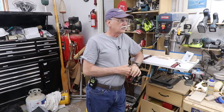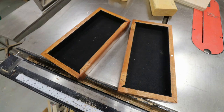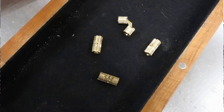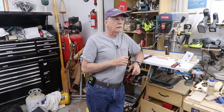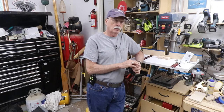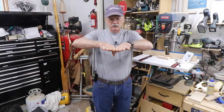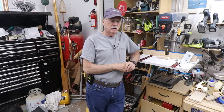Do we really need an excuse to upgrade our tools? Not really — I kind of made an excuse. A friend of mine has this game box that someone had modified earlier with some butt hinges that never really worked right, and when you open the box up to play it, it wouldn't lay flat. So what I'm using are these barrel hinges — they're like Soss barrel hinges but not Soss. These are 8 millimeter, but the depth for these has to be fairly precise. They don't have the expansion barrel like the bigger ones do; you have to put two screws into it, or epoxy them. This way it closes the box up nicely, and when you open it up not only will it lay flat, but there'll be almost no visible seam when the box is opened.